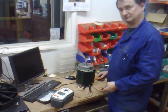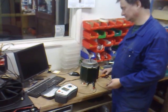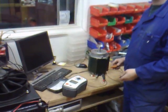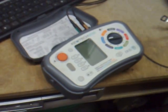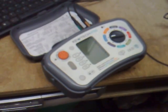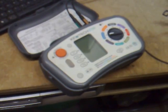Hello. We're here with the GMS M1 motor and we're just about to start our electrical tests on it. As you can see, we have a tester here. We're going to carry out the insulation resistance test on the motor windings to earth using the QTEC KT65 tester, which is in a calibration system, so it's a certified instrument.